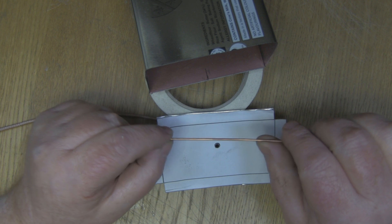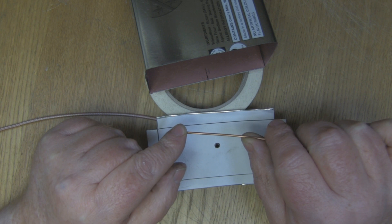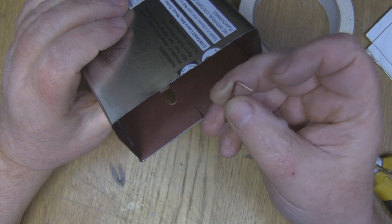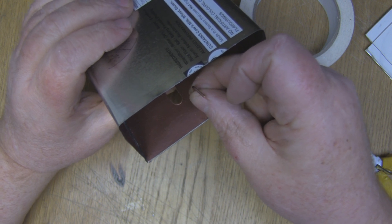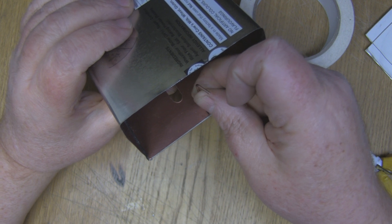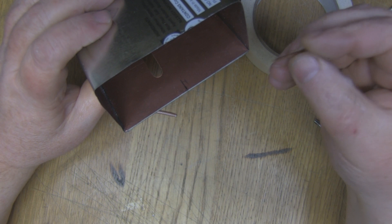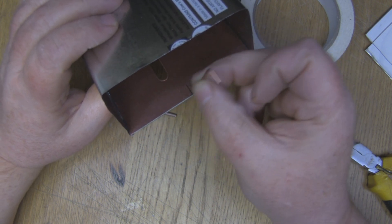The driven element has 31 mm along its long length and 10 mm along its short length. I'm going to solder it at the 10 mm mark directly onto the front of the waveguide antenna. If you're using single-sided PCB instead of double-sided, you can drill a small hole, solder the wire on the reverse side so it sticks out slightly, and just trim any waste. Because I've used double-sided board, I'm just soldering it directly onto the PCB surface. It doesn't need to be a particularly strong mechanical connection — you just want to make sure it is electrically connected.